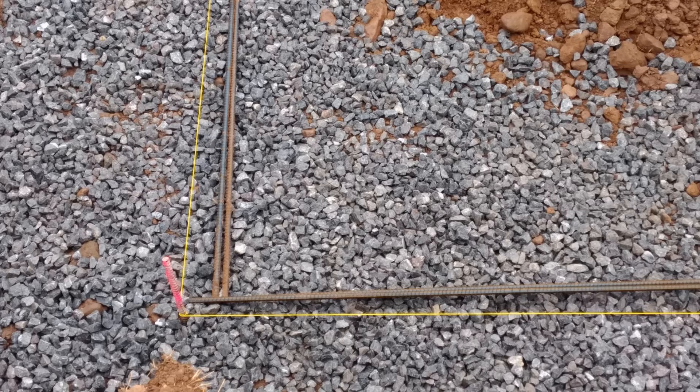Preparing the trench. Add several inches of crushed stone to the trench. Stake the building corners and stretch a string line around the perimeter. It can help to paint the crushed stone along the string line. Use enough stone to make it easy to grade to plus or minus 1 inch with string lines or laser. Excess stone will be mounded up around the footer before pouring.